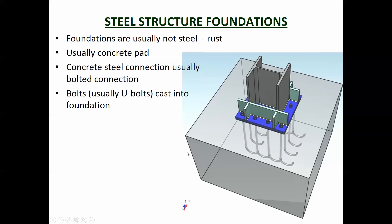This reinforced concrete foundation will be cast into the ground, and there'll be bolts sticking out of the ground — those bolts are actually cast into the concrete. A steel plate is connected onto the column, and that bolts onto the protruding bolts. So the steel plate is welded to the column and all you have to do is connect the bolts to the plate to make the steel structure part of the foundation.